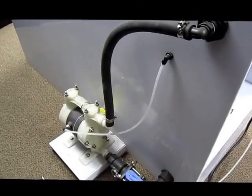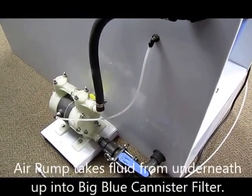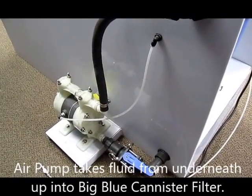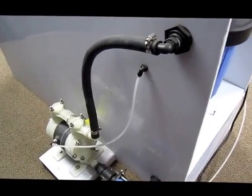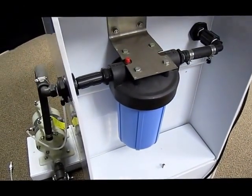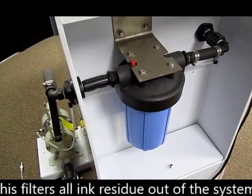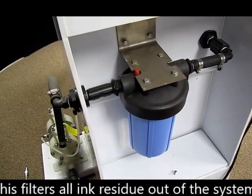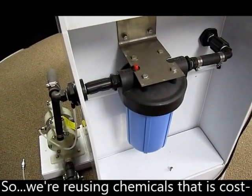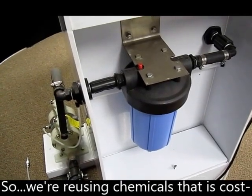On the unit we're looking at here, it has an air pump. That air pump takes the fluid from underneath, pulls it through, up, and into a canister filter — which is the big blue one. That then filters out any of the ink that's been dissolved down into the fluid, prior to it going back into the spray heads that are going to be spraying onto the screen. So we're constantly reusing all of the fluid over and over again, which makes it extremely cost advantageous.